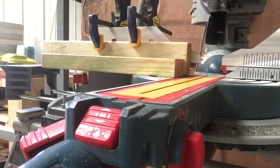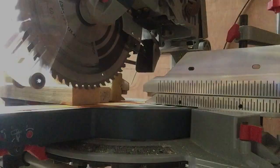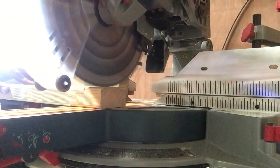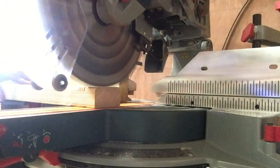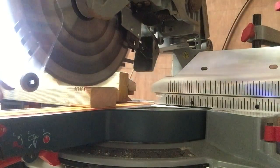Having the cement sheets screwed into place, I'm now putting in extra additional bracing. I'm notching out here a certain amount, going down to the depth which will allow this bit of bracing to sit flat on the actual cement sheet. Just cut away a few notches and then clean it up with a blade.